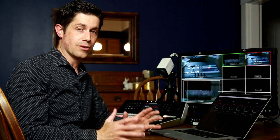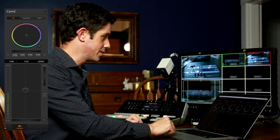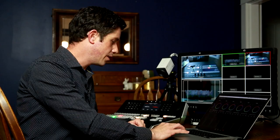In the camera panel, this is where things get really cool with Blackmagic cameras and their entire ecosystem. Number five is my URSA camera, and I have it set up so I can control that camera from this software. If I adjust the gain, you'll notice on screen it gets brighter or darker. I can also adjust the shutter speed, color temperature, and with this dial a combination of exposure. If using a powered lens like a B4 lens, I could also zoom, and I can hit a button to get a larger, more granular view for shading cameras and adjusting color balance.